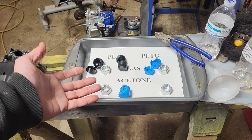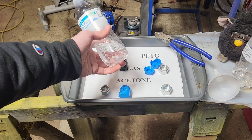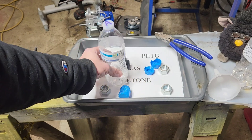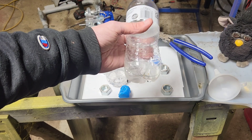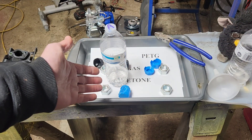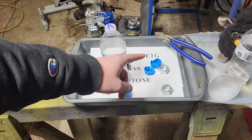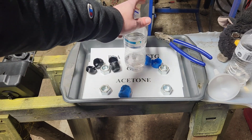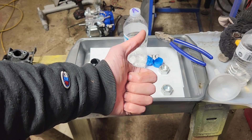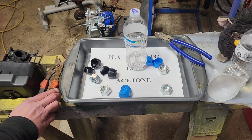Well, I know that's not the most fancy test in the world. We've also got this PET here — and the acetone one is turning to rubber, all squishy. Do I think we can make intake manifolds out of PETG that'll survive for what we want to do? Yes. Do I think if it does not have to come in contact with gasoline, we could use PLA? Probably. Thanks for supporting the channel — I hope this helped you. There'll be plenty of info in the description.